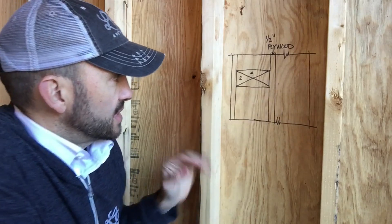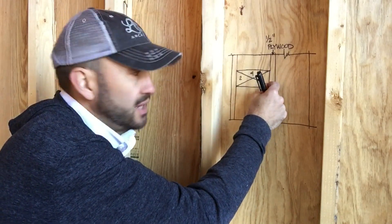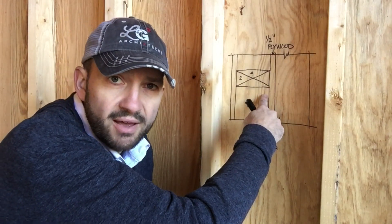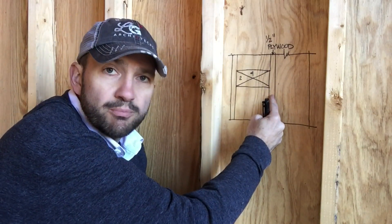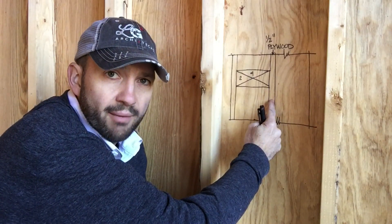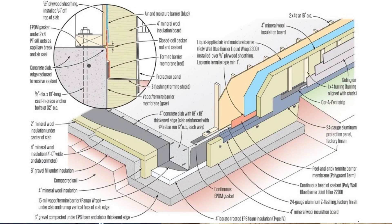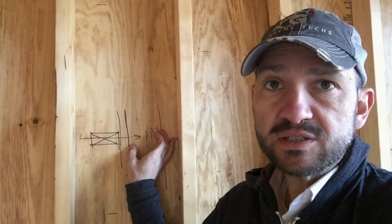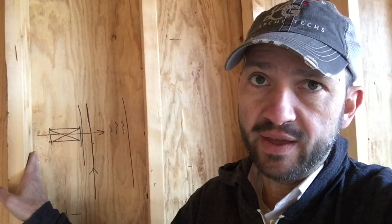Here we've got everything to the outside. We've got our sheathing layer here — this is our 2x4 — and the sheathing layer sits at a temperature much closer to the interior, which might be around 75°F in the summer and close to 68°F in the winter. You're going to lose maybe about a degree across that sheathing layer at most. We have four inches of insulation on the walls and six inches on the roof, and that insulation follows all the way down underneath the slab, about two to four feet in. This four inches of insulation serves as a thermal break for the studs, so we're getting a continuous four inches around the entire building. That's the answer to that one — we'll see you next time, thanks for checking us out.